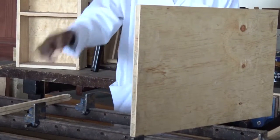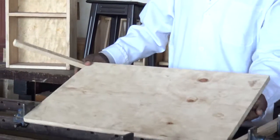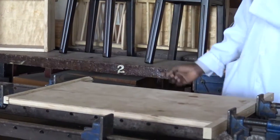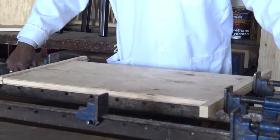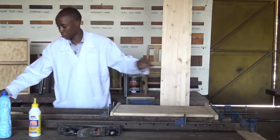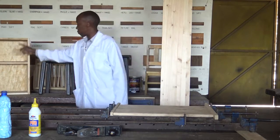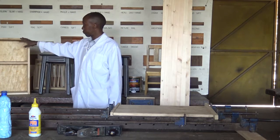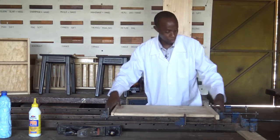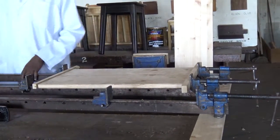In many boards, you will see it is well finished on all edges. To achieve that, we use such a beading. We laminate or put glue and clamp it, give it time after it has cured, then we remove it, do the finishing on it, and from there we can say we have a nice finished board for a door or something like that. So what I'm using right now, I want to laminate for the door to this cabinet here. This cabinet will have a door very soon when we make it together.